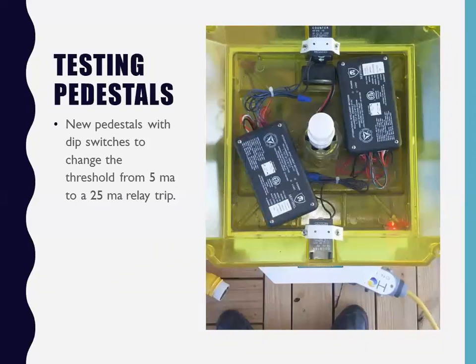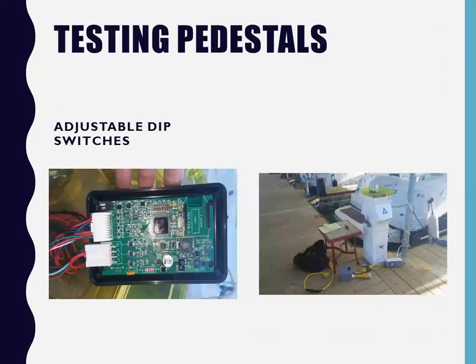So I knew I could fix that with an RF bag. Then I opened up the lid and I found inside that there's dip switches. If you look at the left picture, top left corner, there's dip switches right there, and it allows you to set the threshold anywhere from 5 to 25 milliamps. So I just went ahead and did all 6 pedestals at all 4 marinas. I went to all of them and just set them at 25 to get rid of the nuisance tripping,